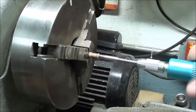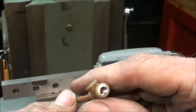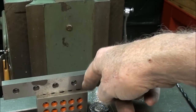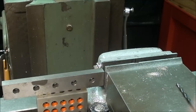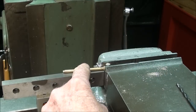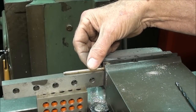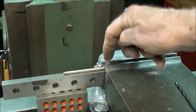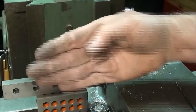This is a long video, a little longer than I thought it would be. Now take a look at how I'm going to drill and tap the third hole. Holding it again in that little arbor and using the same Rube Goldberg setup with a 1-2-3 block — then I had to change the parallel; this is only a 1-inch parallel — with the rod sitting on there and tightening it up.